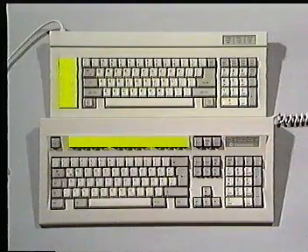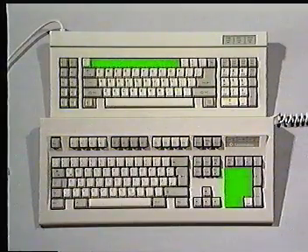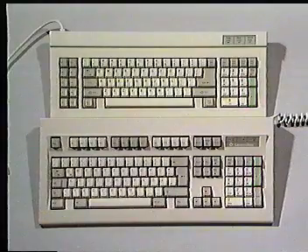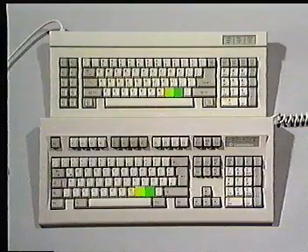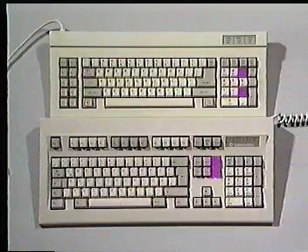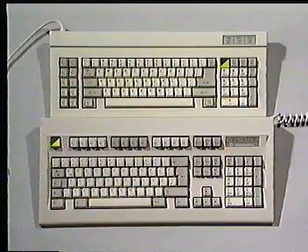The yellow keys are the command keys from F1 to F10. In addition, you have the number keys which we use to enter numbers — here marked in green — and the plus and minus keys. This is the decimal point, flashing in green. And to separate two different numbers, the comma sign in yellow. You also have the page up and page down keys for changing the cursor path, and the escape key with which we can either abort a program or return to the next higher menu level.